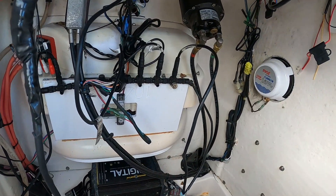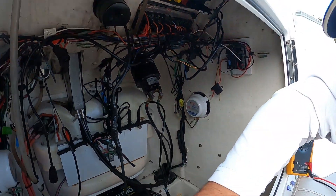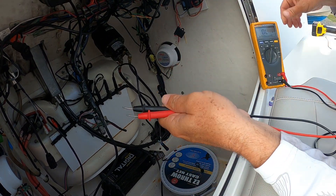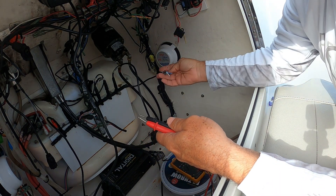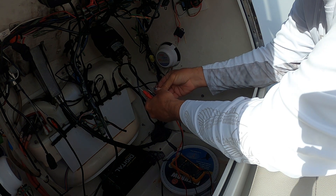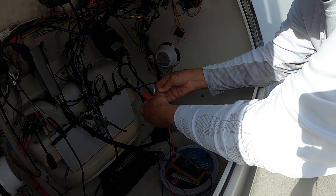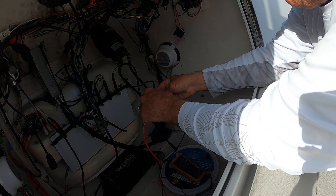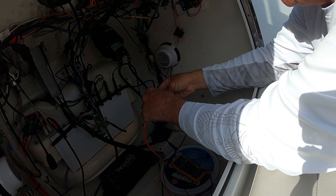If I don't get 120 to 119, then I have something wrong with one of my devices that's keeping the whole thing from working. I'll show you what I did. I've got my cheater cable in — it's the only way to do this because these pins are so small. I've got my blue and white, those are my resistance wires. You need 120 to 119 ohms resistance.